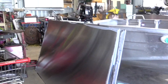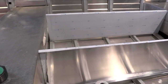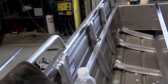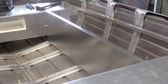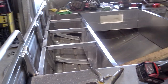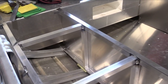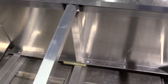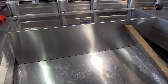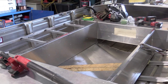We inserted two braces in between the two front seats. Then we mounted some square tubing to the side, level with the seats, in order to give us somewhere to mount our top plate to. Then we needed to brace it all, so we braced across to that centre piece, built some frames, put it off the initial frames of the boat, and welded it all in. We put a lighter piece of alloy across the floor, level with the floor, but made sure we left gaps underneath the seat so that I was able to hose stuff out when needed.